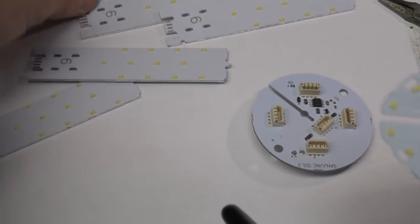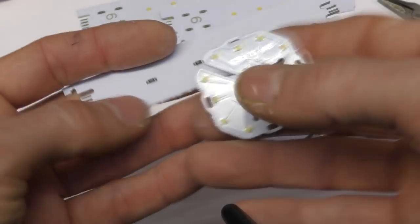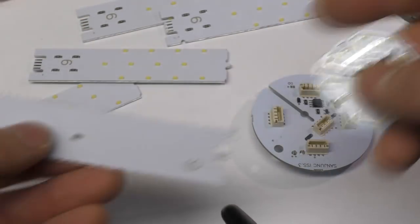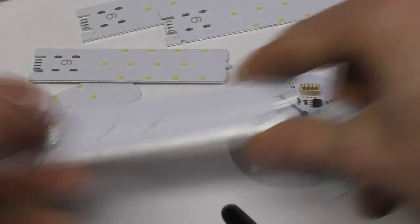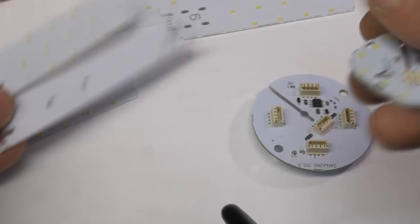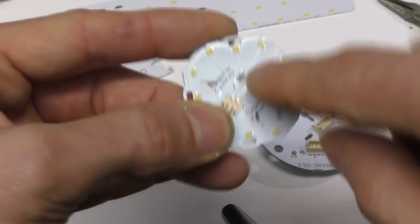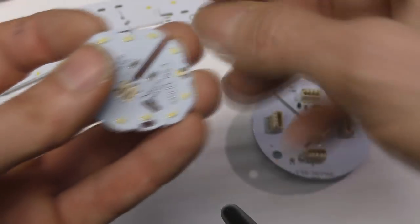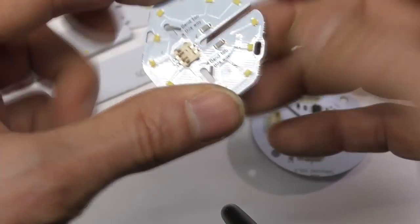And one reason we've got resistors both on this vertical section, which powers this, and the top board was really so we could adjust. These weren't both manufactured at the same time. It meant that we could assemble the entire panel with all the same resistor value to minimise the bill of materials. Then we could use this resistor value to tweak how much dimmer these LEDs were relative to that one, just to give us a little bit more control.